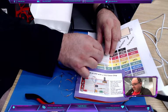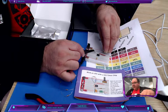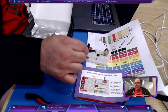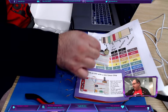Pin 6 to here. Now that I know the length of my wire and how far it goes, I'm going to grab my fun little potentiometer. Because I know that wire goes to the middle pin of the potentiometer, and they've got 3 pins, we're going to use 2. I'm going to line it up. I was a little off. And put it in. So now I know where my 555 timer belongs, my ceramic 106 cap goes. I've got a wire leaving my 555 timer to my potentiometer. And we can keep building this out.